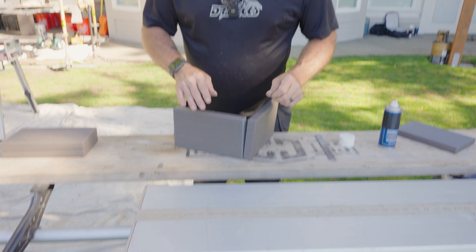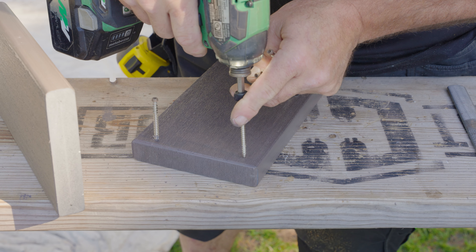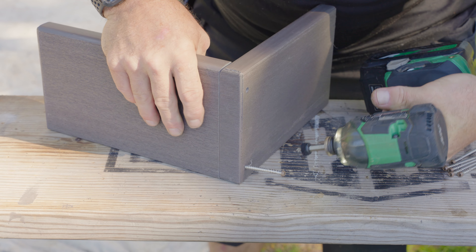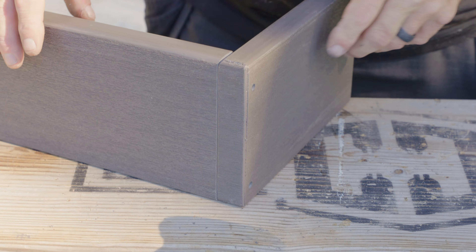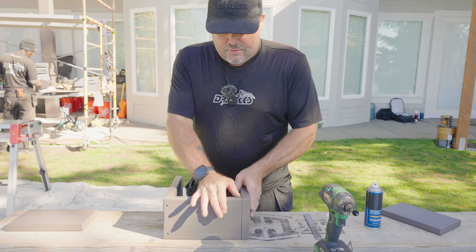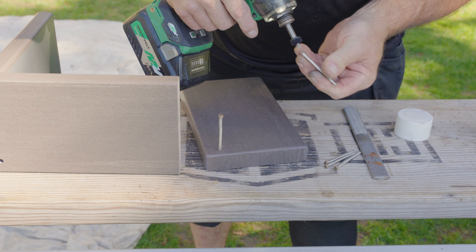So I just need to get a drill and some screws and we'll screw this together, then go install it. We're just going to use two screws per joint. Because we're using a butt joint, we can put two screws through the side — I'm going to use stainless steel top lock cortex screws and a cortex bit. That's going to allow us to take these two pieces and screw them together. I put my top end first, then lean this until I get it flush. That side's done — that's a butt joint instead of a miter, but see how nice it looks? Then we'll put cortex plugs in and you'll never see the fasteners. One side overlaps the other side, so you're always covering up one end grain when you do it.